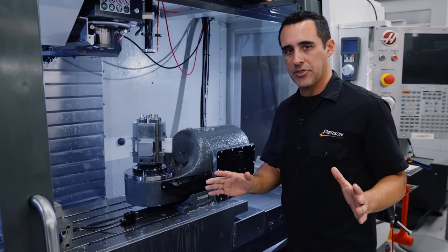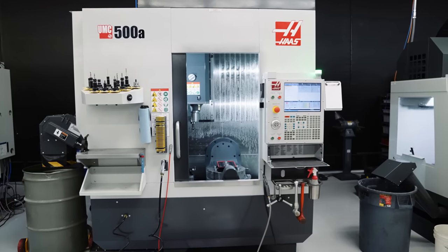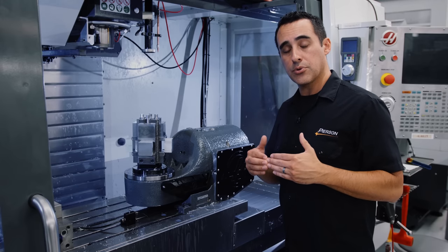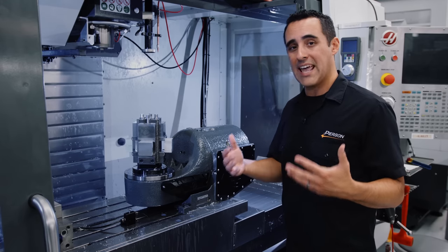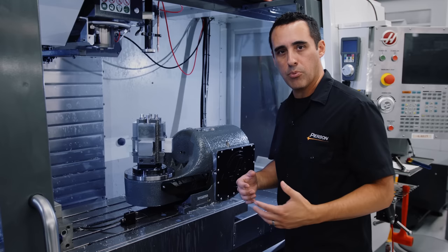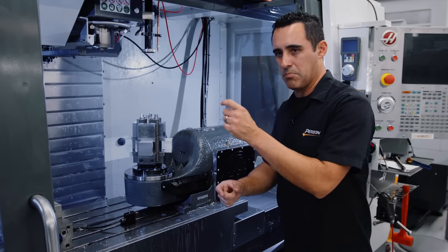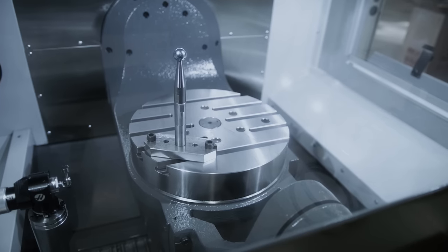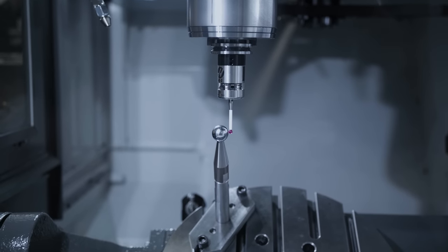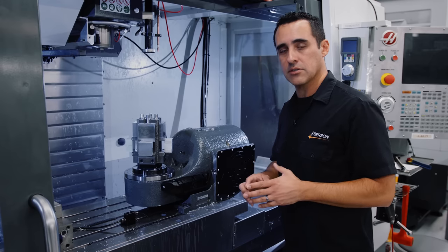What's different about this compared to the UMC 500 is that on the UMC 500, finding the center of rotation is done through software known as MRZP — Machine Rotary Zero Point — where you have basically a probe or calibration sphere mounted to the table, and the machine goes through a pre-programmed set of calibration cycles to find the center of location.